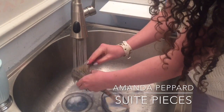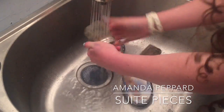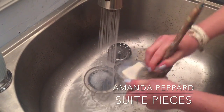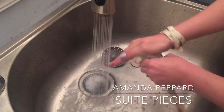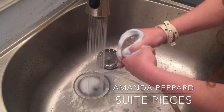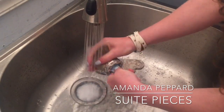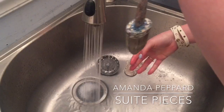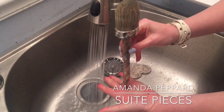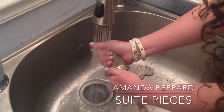You can see here, this is cleaning up so nicely. Had that been a latex brush it would have been completely ruined. It's always important, after you wash your brushes, to make sure that you leave your soap nice and dry — don't leave a lot of water in there because that will eat away at the soap and degrade it much quicker. When rinsing your brushes, make sure the water is running clear. When you dry your brushes, you want to either lay them flat or hang them — that's why they have that handy hole in the handle. You never want to dry them standing straight up, because the water will get into the ferrule, which is that metal part, and it will rust out the bristles and ruin your brushes.